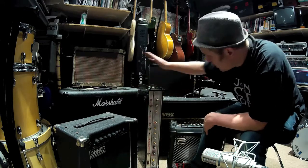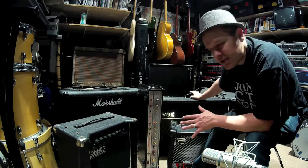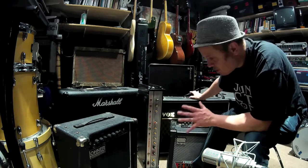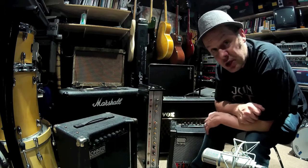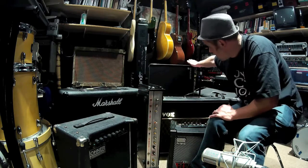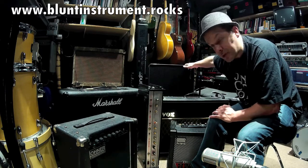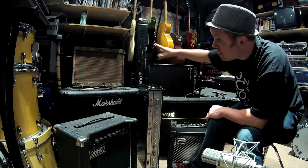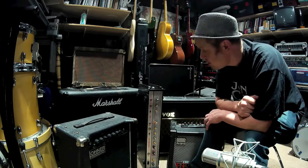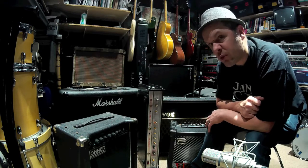This amplifier, the Marshall, and the Vox AC30 all have speaker impedance switches, which are more designed to cope with extra cabinets rather than tweaking midrange — though the midrange change is a byproduct of that impedance shift. Some cabinets are fixed: the Blunt Instrument VS315 is a 15 watt amplifier with a fixed 8 ohm speaker, and likewise the Fender 40 watt is also an 8 ohm setup. So there are lots of different sounds, lots of possibilities, and lots of pitfalls not to fall into.